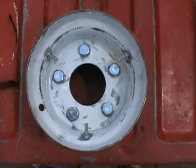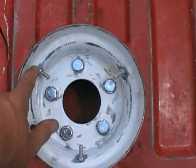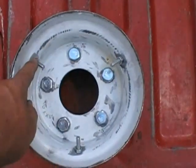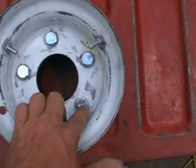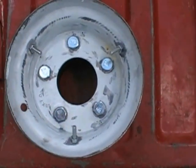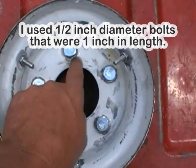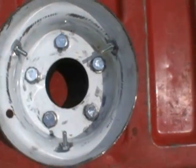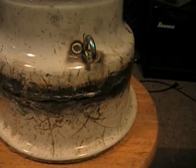In the excitement of making the video, there was something that I forgot to mention, and that is where you drill the 3 holes for your hooks. They're going to have your chains on them. You got to get inside here and take the grinder and knock off the enamel here also, so you can get a positive tack weld. The same applies for your bolts right here. I actually went around the sides of the bolts and gently brushed them with the grinder to knock off any galvanization, and I also went to the bottom of this rim right here and knocked off all the enamel where they sat in here. This way I can go around it and tack weld it, so don't forget to do that. I almost forgot to bring this up in the video here.